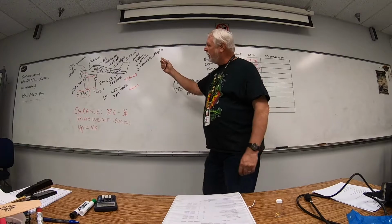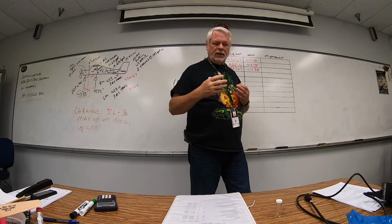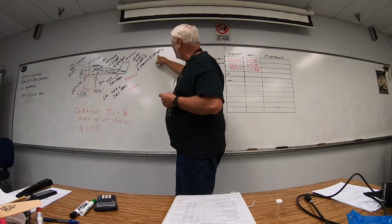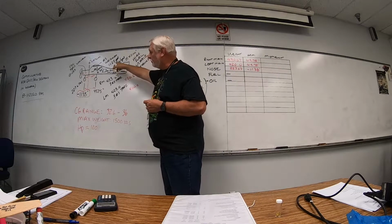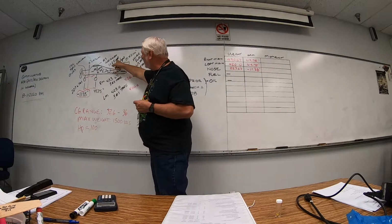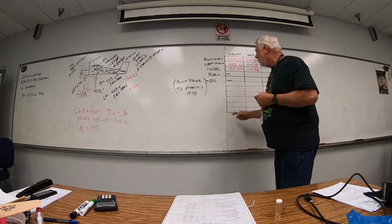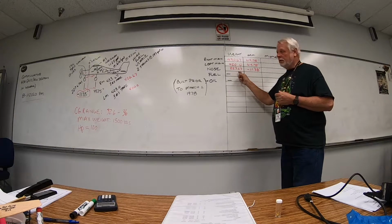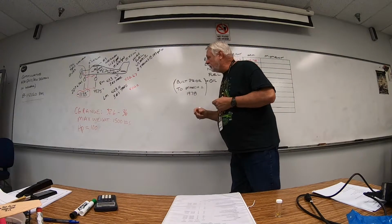We know what the maximum capacity is right here. Now you can calculate that. In this case, we had a maximum of 14.5 gallons per tank. And as weighed, this is both combined by the way, 11.25 gallons at 6 pounds per gallon at 42 inches. We have to take the fuel out. That's a negative number. So that's why I built this box the way I built it.